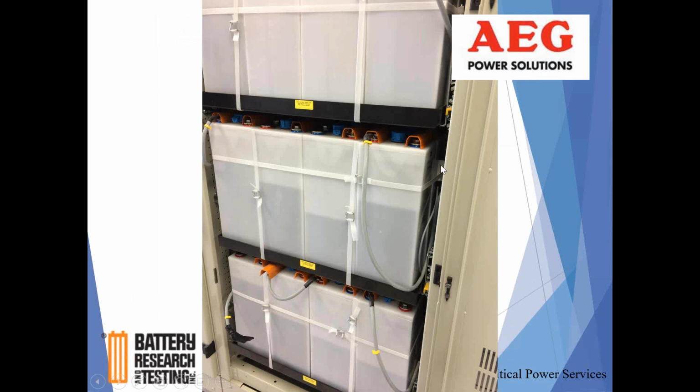We really should have that drawer slid out, but the sensors are mounted to the side of the pilot battery cell, and it's looking for electrolyte level. These drawers pull out, and these cells are installed in such a way that you actually can't see the electrolyte level on the batteries. Now here the cells are somewhat opaque, so we have pretty good lighting in this particular room, so we can see the level. And this is actually a problem.